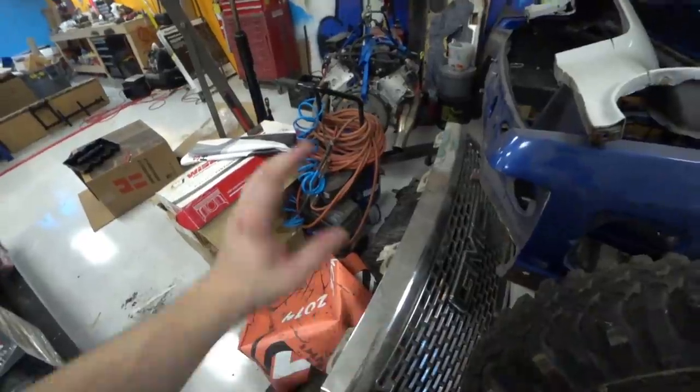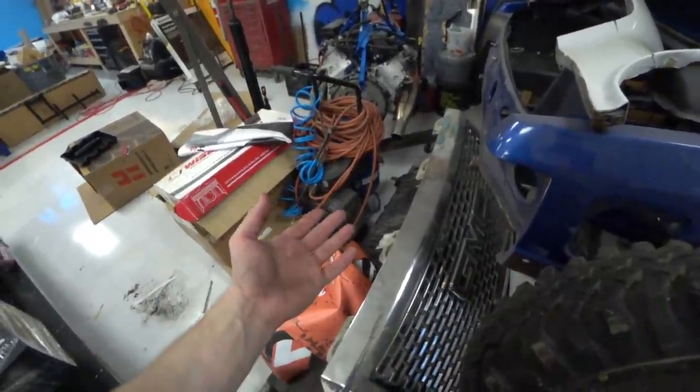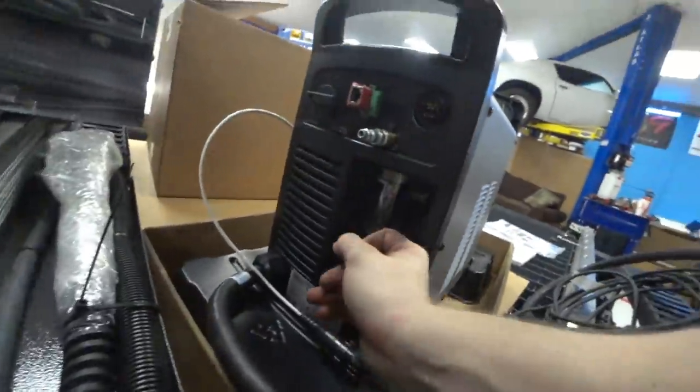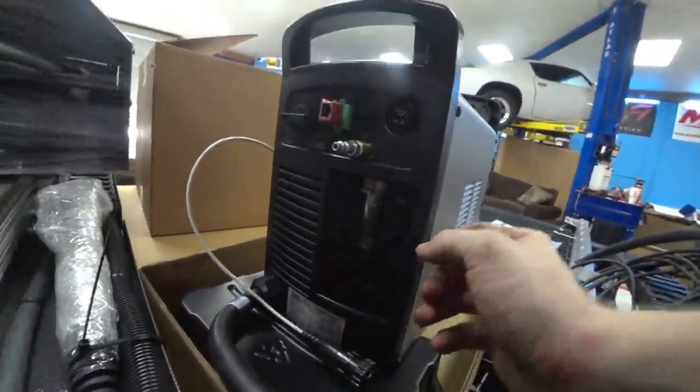Technically, it's got enough power to run the table for a plasma cutter, but it doesn't have enough to run it sustainably. And it certainly doesn't have enough power to fill all these airlines. It's also louder than the air compressor that I have ordered. So I'm gonna get on the phone with the company that makes the air compressors and hopefully they'll have something for me, because we're like 4 weeks into like a 10 week build out. I might just go buy a bigger air compressor to run in the meantime and then sell the air compressor. I know that sounds really absurd, but that just might be what I do. Oh wait, is this the air dryer? Already built into it. Nice.